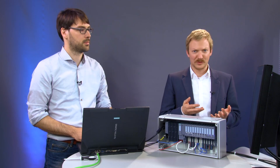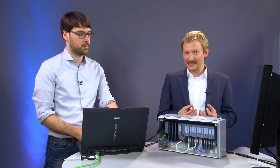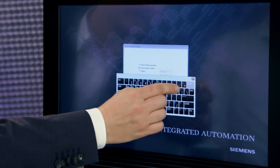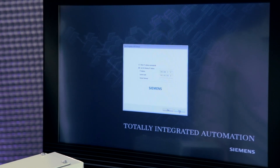For the initial installation, I only have to accept the license conditions. As a final step, I can now specify an IP address — this can also be done later from within the Windows operating system. In this case, it makes sense to use the same network IP address used in my automation program for initial commissioning. Let's have a look at the TIA portal to see what is configured. We open the network view in the TIA portal and look at the OpenController to see what address is given there. There is a clever button at the top — Show IP addresses. The OpenController has two Ethernet interfaces; it has the address 0.1. We will change that here now: 192.168.0.1. And that is the end of the setup.